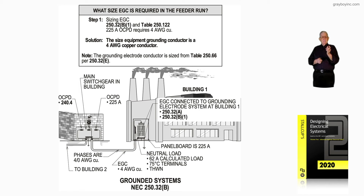People ask: if that was a 600-amp or 1,000-amp service, is number six all you'd need? Yes, that's correct — if that was the only electrode you had. If you had a concrete encased electrode, it'd be number four by 250.66B. And if a ground ring encircled the building and it was number two, then you'd need number two to it.